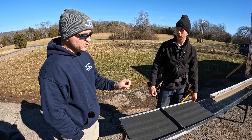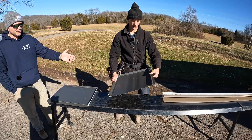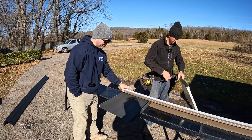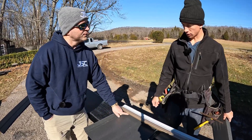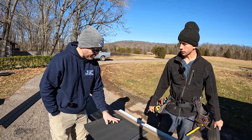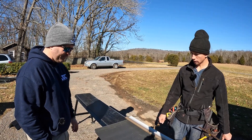This is what was really impressive to me when they came out a few months ago. This is a piece of j-channel, similar to what we'd use on any other metal product — just bigger to accept this panel. It slides in here, so at the end of the day that's providing some of our leak protection. This lip is actually where your ridge cap is going to hook over. You rivet each splice in the ridge cap into the face of this, and we go in the side — not into the top of it, where we'd be creating more of a problem.